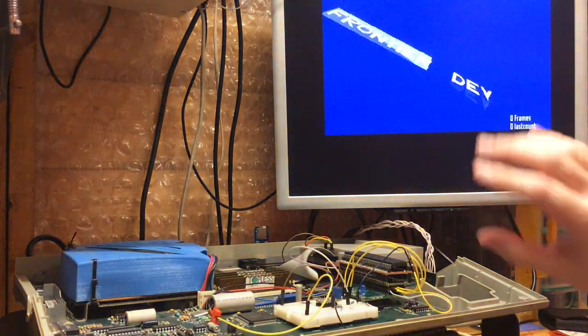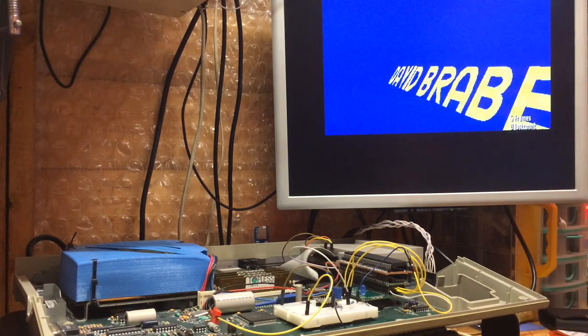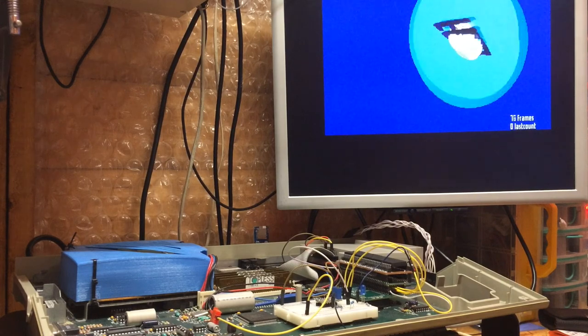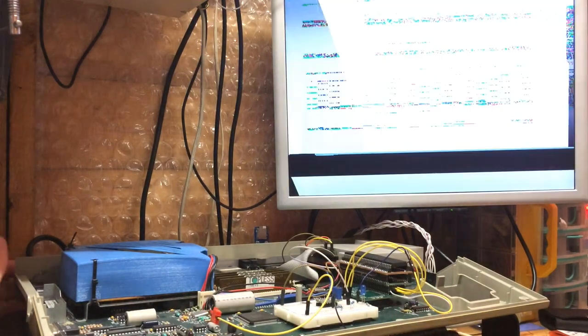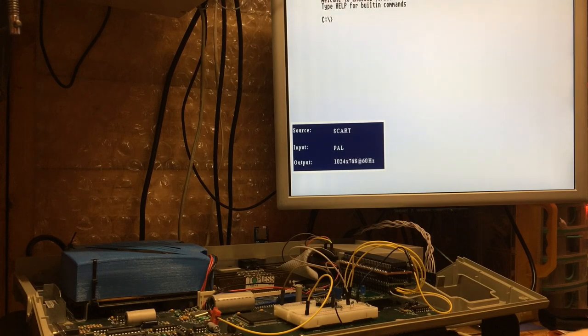Now, we can run Frontbench, but I'm not going to let it go all the way through because we've been here before with just the 60 megahertz switcher, and we get about 940 frames, which is not a great improvement over the 850 you get stock. So I'm not going to go down that road today, but instead we'll just demonstrate the fast RAM. I've redeveloped the SDRAM driver I've got on here, and it's now a little bit more efficient. I should be able to show this off.